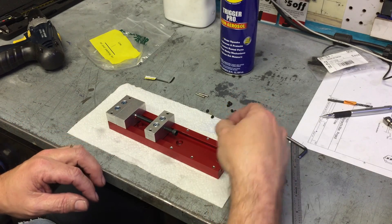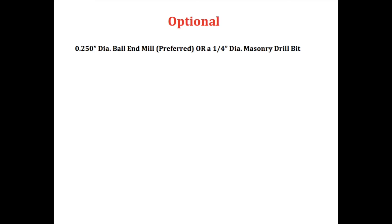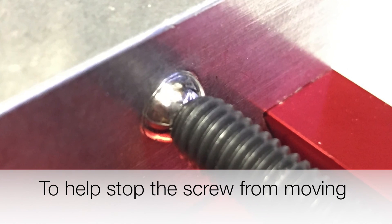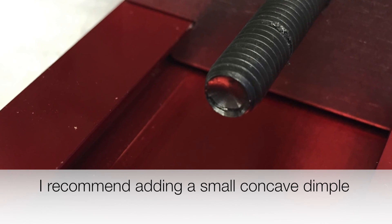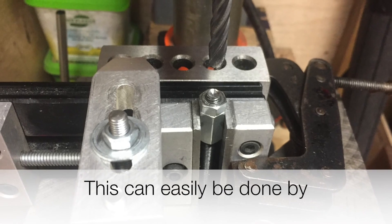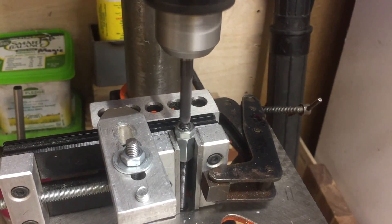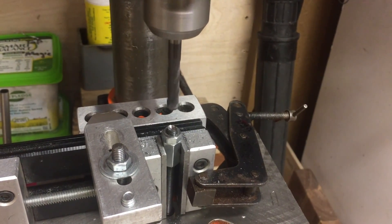I get excited being able to apply 1,500 pounds of force to this vise. While the vise is complete, I have a recommended upgrade: because we're using a 70 millimeter long hardened screw against a hardened ball bearing, it could theoretically slip off center. If we apply a slight concave surface using a ball end mill or a standard quarter inch drill, we guarantee that the bolt will stay secure no matter how many foot-pounds of force we apply. It's just a good thing to do.